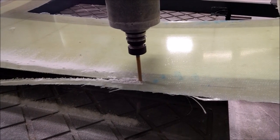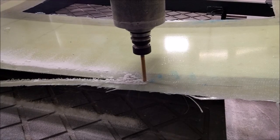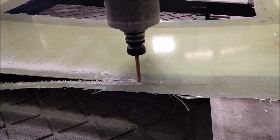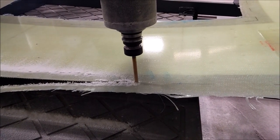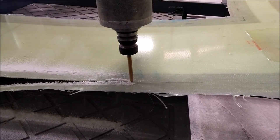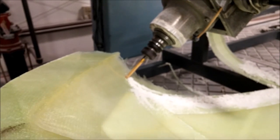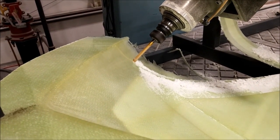In the meantime, here's the cradle for the jig — it's basically attached to the steel frame of the jig with the alignment pins that we've got. Now we're running the mill around there to trim off the rough edges of the fiberglass, and here you can see it's almost done, doing the second last pass.